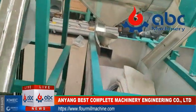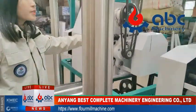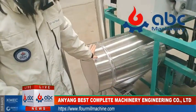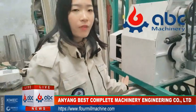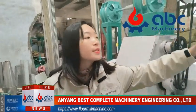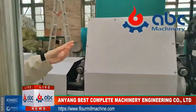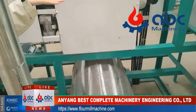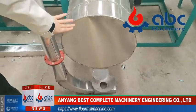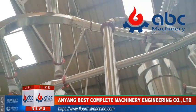For this grinding machine, this one is the first grinding machine. After the first grinding machine, the wheat goes into this round sifter to separate out the qualified flour. The unqualified bran with flour goes into the second grinding machine. After the second grinding machine, the qualified flour also goes into this sifter, and everything goes to the packing part.